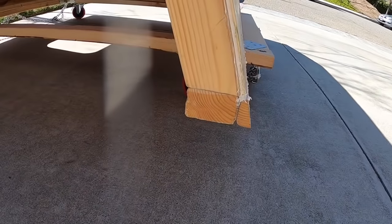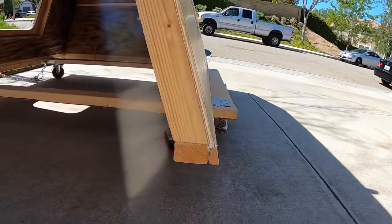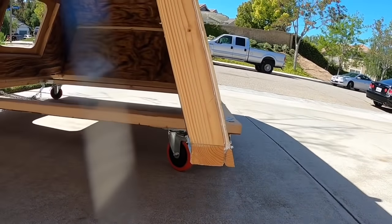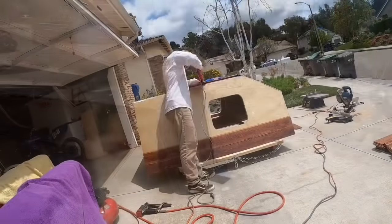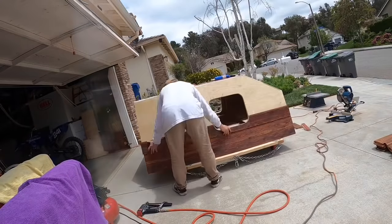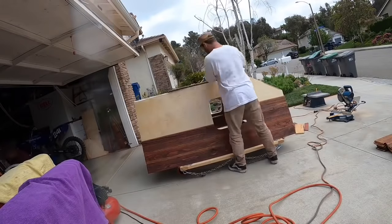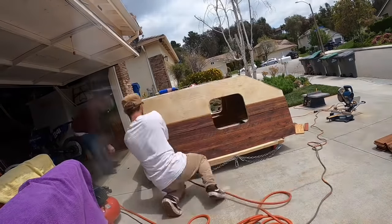This happened to be a little mess-up on my part. Instead of a 2x3, I should have used a 2x4. I had to add a little extra piece of wood there to ensure that my outer surface was nice and flat for when I applied my shiplap. Using a jigsaw here to cut the shape of the window for that exterior redwood — glue and staple gun to adhere everything to that outer surface.